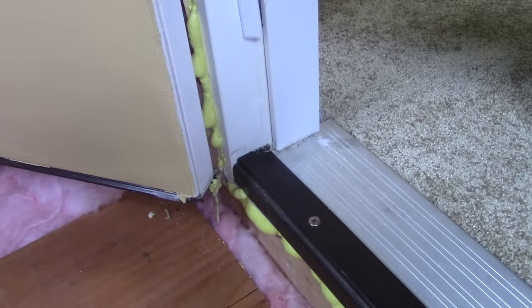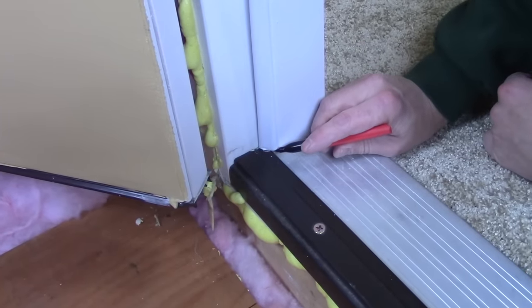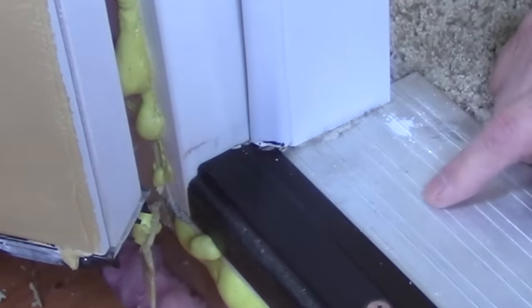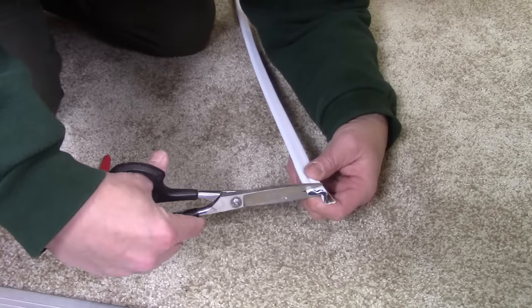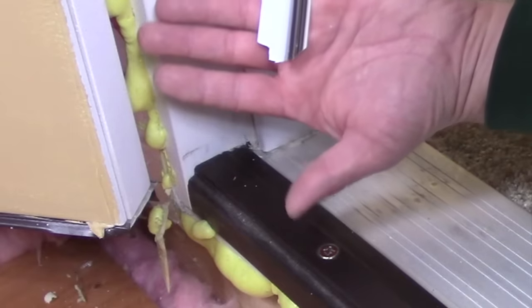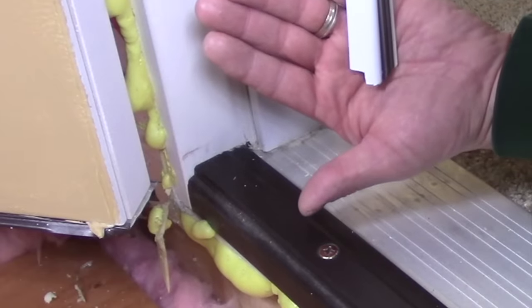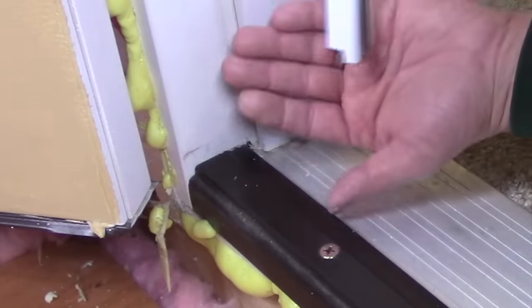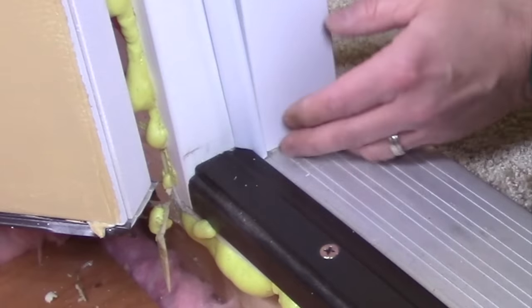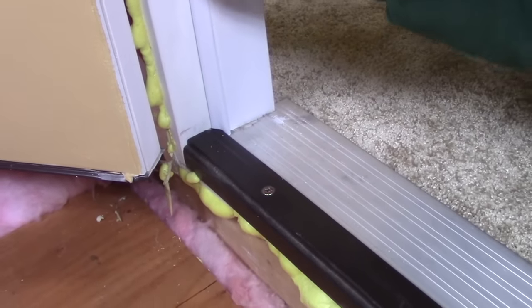I like to start on the side and just kind of tuck it in and slide it down. I'm not putting the whole thing in right now. What you want to do is just notch out the bottom of your weather stripping — cut a little bit off like this just so it goes around the little threshold here. I'm just using a pair of scissors to cut this. I had to trim the notch a little bit more, but this is what I needed to do to get a good fit. You'll notice that I cut an angle back here because there's some caulk deep inside the groove and I wasn't able to slide it all the way down. So just take your time, trim a little bit at a time until you get a nice good fit. It's touching all the way around and it's not bunched up and pinched like it was before. Then just work your way up to the top sliding it in as you go.